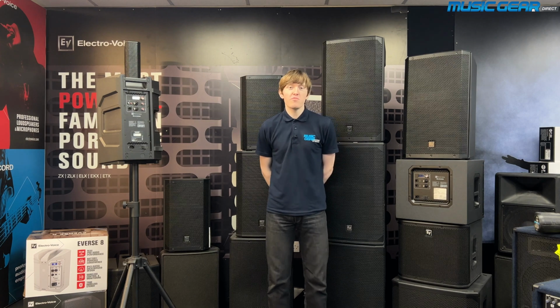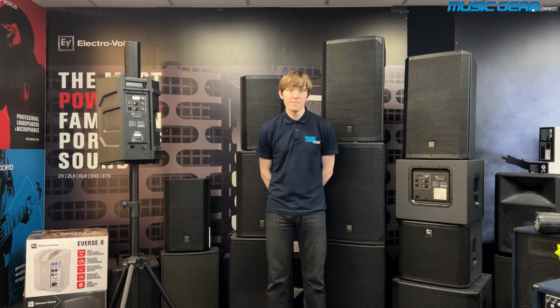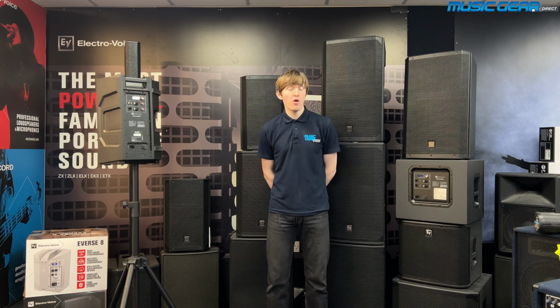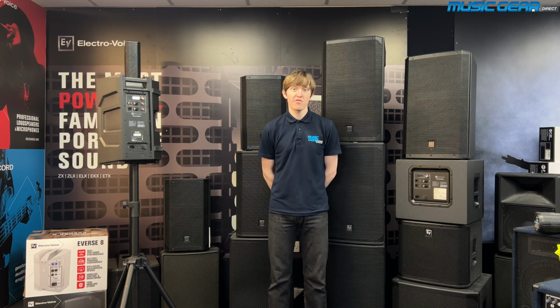The next adjustable setting is the sub menu. You can select a high pass frequency crossover that optimizes your loudspeaker when paired with a subwoofer. Within this sub-menu, there are a few different high-pass options: 80 Hz, 100 Hz, 120 Hz, and 150 Hz. Likewise, the ELX200 series top speakers also feature high-pass crossovers specifically for Electro-Voice branded subwoofers.